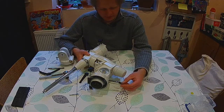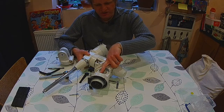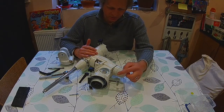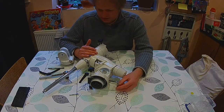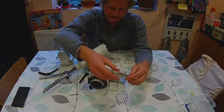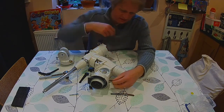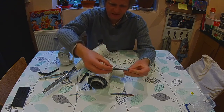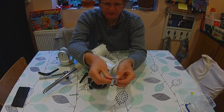It's really common for these to bend inside there. The design is that there's just a little metal pin, and this screw adjusts the height by pushing it round, and this one locks it. In these early mounts, the actual thread is M8, and Skywatcher quickly realised this was not thick enough because so many of them bent. So they replaced it with an M10. The newer mounts have an M10 — you can see the difference quite clearly between the two: the M8 and the M10.